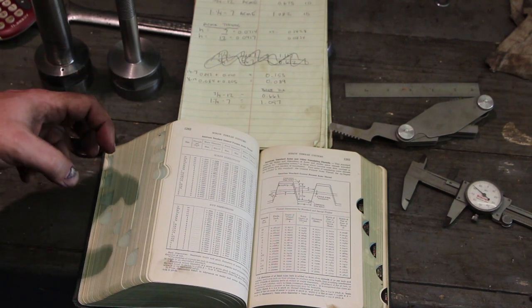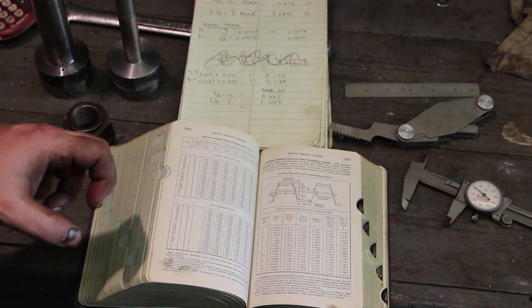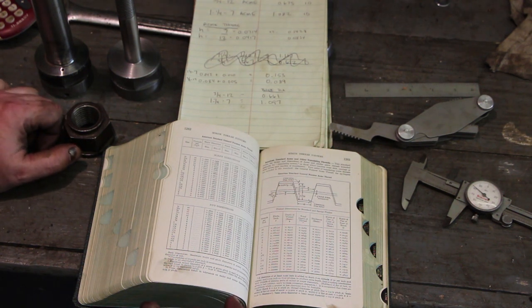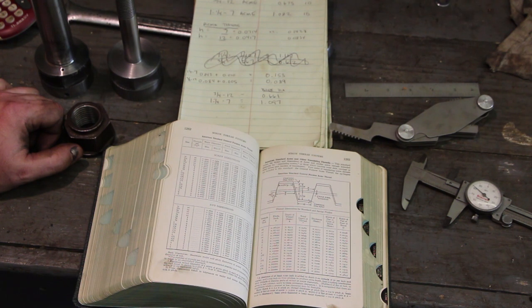I took that measurement and doubled it, because obviously we have to take that much off each side for a diameter. Then I read down in the note at the bottom, and it says a clearance of at least 10 thousandths of an inch is added for depth H on threads of 10 per inch and coarser, and 5 thousandths of an inch for finer pitches. So, doing all my math, I was able to take the depth of the thread, double it, and then add on to that diameter. It'd be 20 thousandths and 10 thousandths, because we need to add 10 and 5 for each side.